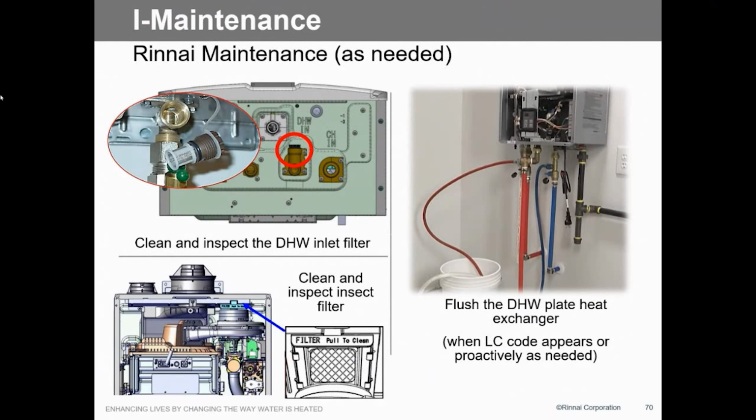And the other thing I run into when you do clean these, if you do have debris in here, you still have this plenum up here. So either take that piece of pipe off and blow it out, or run a vacuum down here and here to help get any loose stuff out of there. That's the only thing I've found. Sometimes millers will get in there, but they're still loose. So that's the maintenance. That's it.